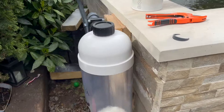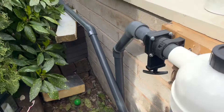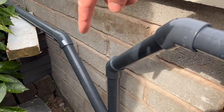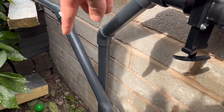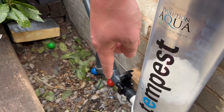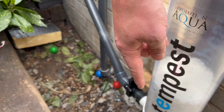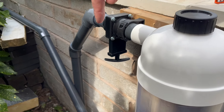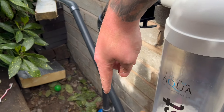So we come round here and we can see - took the ball valve off there. 45 degrees down, 45 degrees in, up through the Nexus Tempest, out 45 degrees, 45 degrees back into the low return.